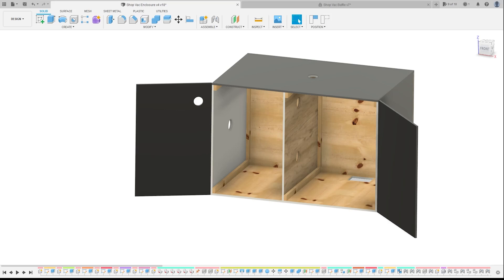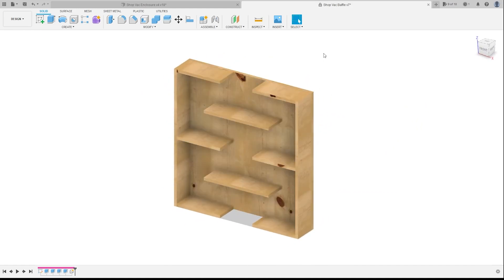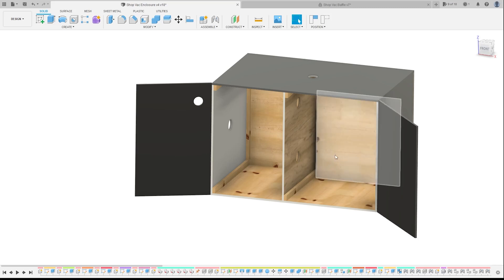So here's what I came up with for the shop vac enclosure — it's a big box. I did divide it into two different chambers. One of them is going to hold the shop vac and the other side is going to hold the dust cyclone and the hose reel. I separated them so that we can insulate the shop vac side with acoustic foam and try to capture as much of the sound as we can. I'm also going to install a baffle. This baffle is going to take the air coming out of the shop vac and make it not be able to follow a straight path out of the enclosure — it's going to have to travel around all of these dividers. This is going to be filled with acoustic foam as well, so any sound going through here is going to be both bouncing off of these surfaces plus being absorbed by the foam. So I've got the baffle here — it just mounts in the back of the vacuum chamber.